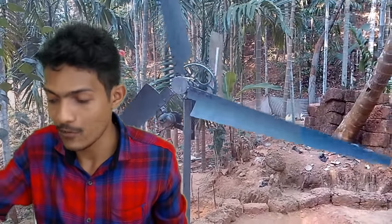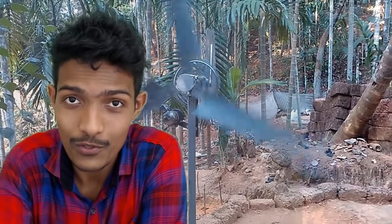So these are the main components, and this is the working of a horizontal axis wind turbine. And once the dynamo generates electricity, the electricity is sent down to the wind turbine base. There is a step-up transformer which steps up the voltage to a higher voltage, which is convenient to send to the grid. This is the working of a horizontal axis wind turbine,